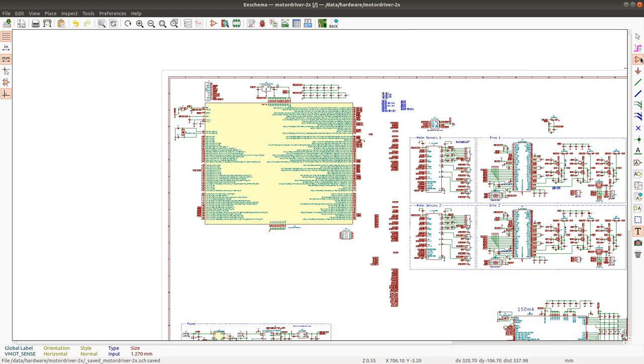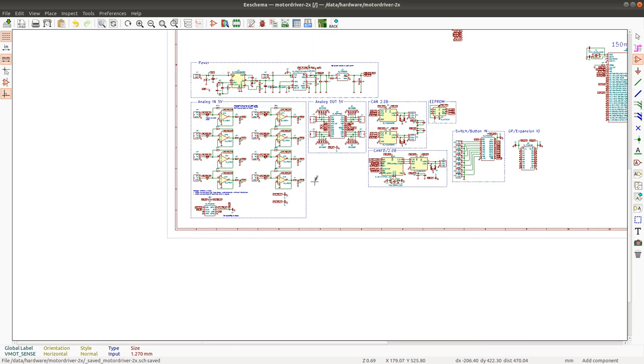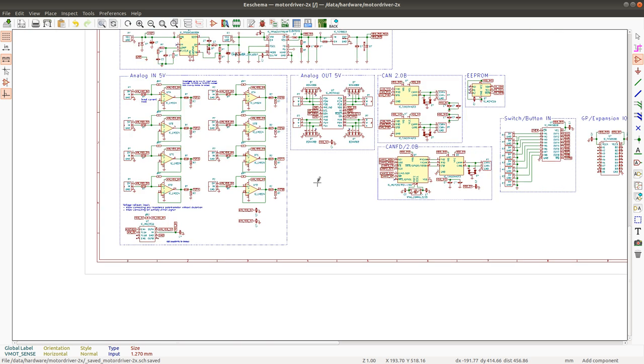So going back to this schematic, I'll place it actually here. And by the way, I'm going to change this amplifier to a different variant, because even though this amplifier has a rail-to-rail output, it doesn't have a rail-to-rail input. I've been researching this a little bit more, and this amplifier has a VCC minus 2 volts input, which I actually saw when I was reading the datasheet, but I decided to use it anyway, and I realized it was a mistake, so I need to change this amplifier to another one. But for now, I will just add the multiplexer.